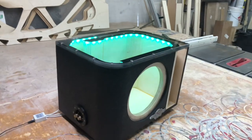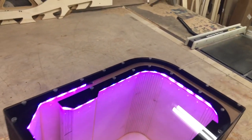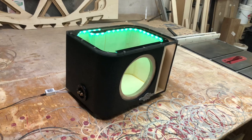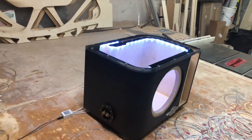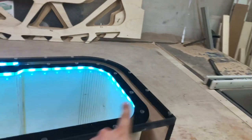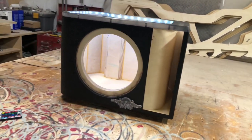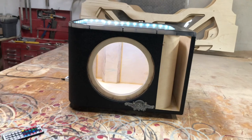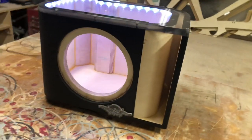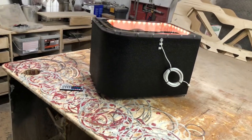The silicone is just for sealant. It does have some adhesion property, so it will help stick it, but really the two-inch screws are going to be what holds this thing on. We've got the perimeter painted black so you're not going to see that bare wood on the top. I think a lot of times I see plexiglass top enclosures and they miss that little detail of painting this outside ring — that gives it a really nice finished look. The kerf port with the bare wood finish coming out the outside definitely ties everything in really nice.